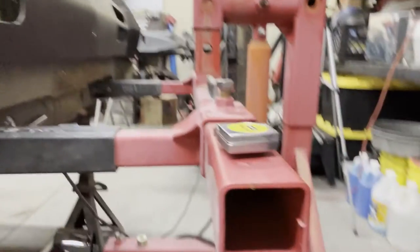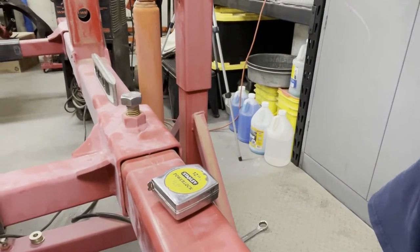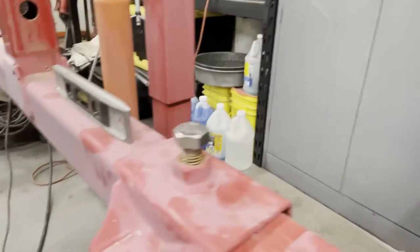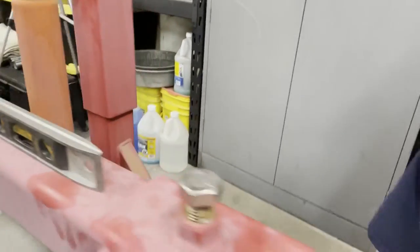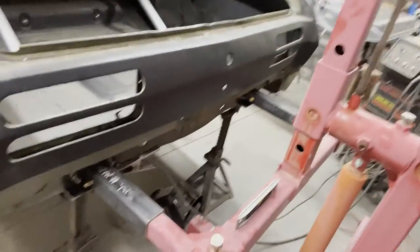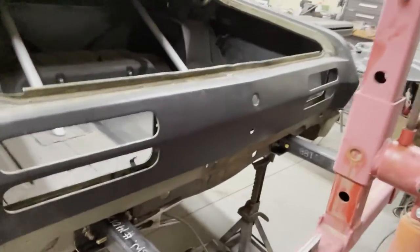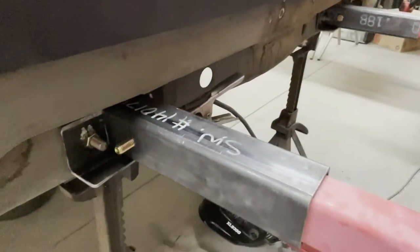And again, just like the front, you want to make sure that you measure for center, make sure it's centered. Something that might not be a bad idea — I just put a bubble level on there, make sure everything's level and square and straight. So I'm going to go ahead and get welding these brackets on there. They're just sitting on there right now, but they're in place where I want them. I'll put a couple tacks on there on both sides, on both arms, and then I'll take them off and weld them up solid.